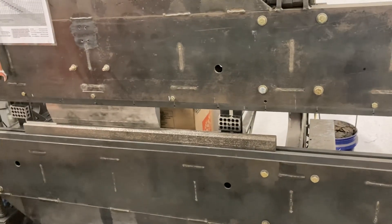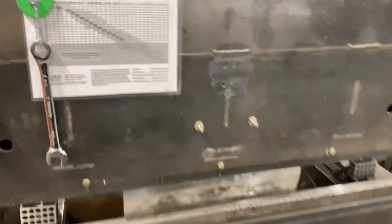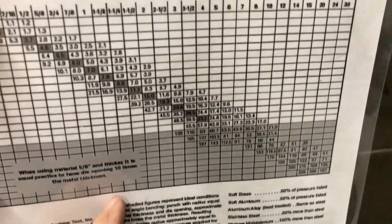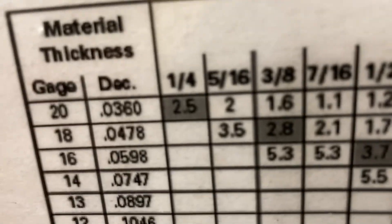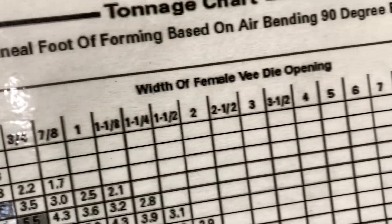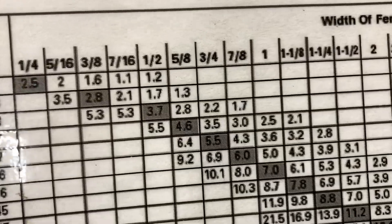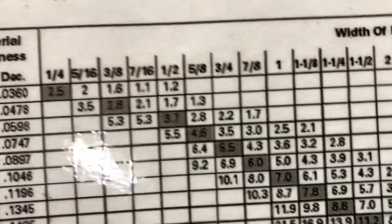That's the way I do it. I'm sure professional press brake guys can probably do it faster — I'm self-taught with most of this stuff, so I don't know that I know the right way. But this is something that's cool to have. You can just print this off — I just Googled it — it's a press brake tonnage chart. You've got your material thickness and your V-die width for your bottom V-die, and it gives you how many tons of force it takes per linear foot of part. The shaded box is like your sweet spot, and it gives you values either way.